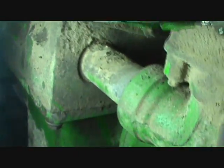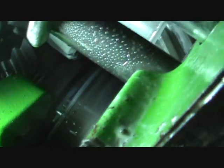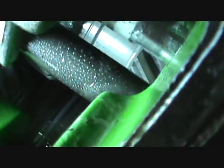It should have an O-ring in it, but I don't know. You know, sometimes you gotta tap on them with stuff, but it looks to me like it'll break out of there pretty easy. It looks like an O-ring sealed type thing. Yeah, again, we got the oil out of there. There is a power shift pack down there somehow. I think that's for the four-wheel drive. Matter of fact, I know that's for the four-wheel drive unit. It drives off of the parking gear.